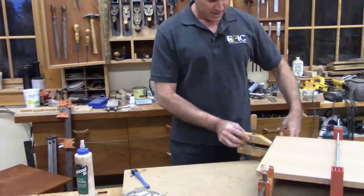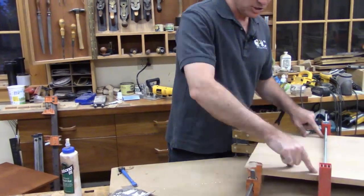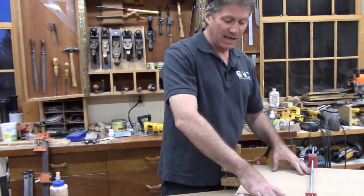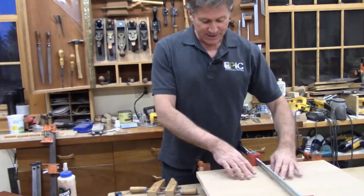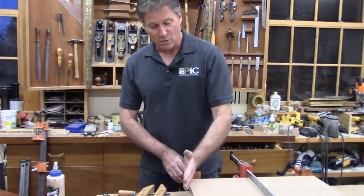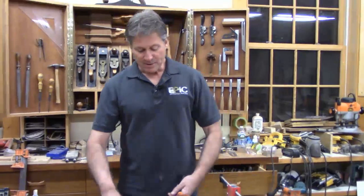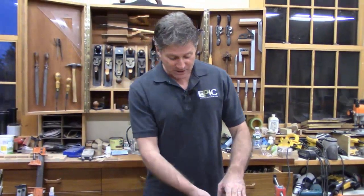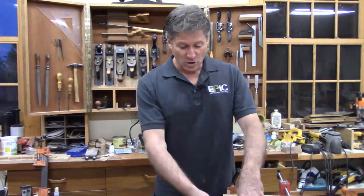Yes, there are times when it helps to put a clamp. You can apply a bit of clamp pressure here, or sometimes you can stretch a board across and clamp this way, which will help align them. In a small, simple project like this, I know from having done this that it's not a difficult glue up, and I can just adjust as I work across the board and get it plane enough, and then I'm going to dress it and really get it smooth. In some cases, you may find that you're having difficulty aligning the boards, and you would find that out in the dry run. You should always do a practice dry run when you've got a glue up of any complexity coming up, so you know things are going to work well once you start flowing the glue.